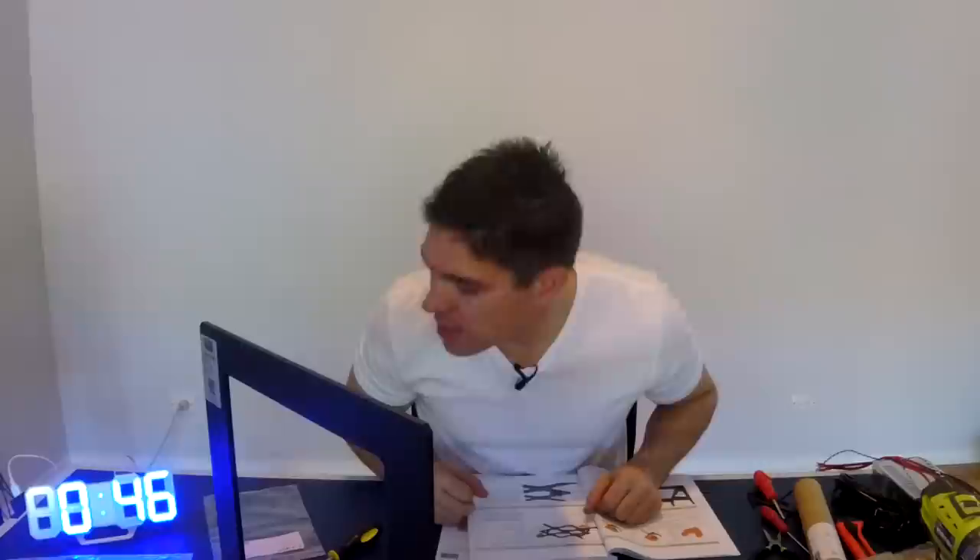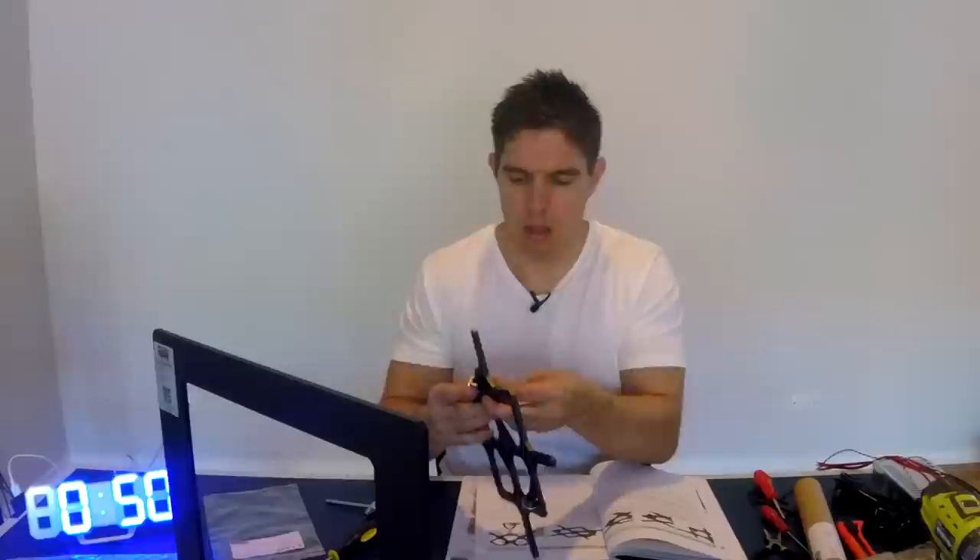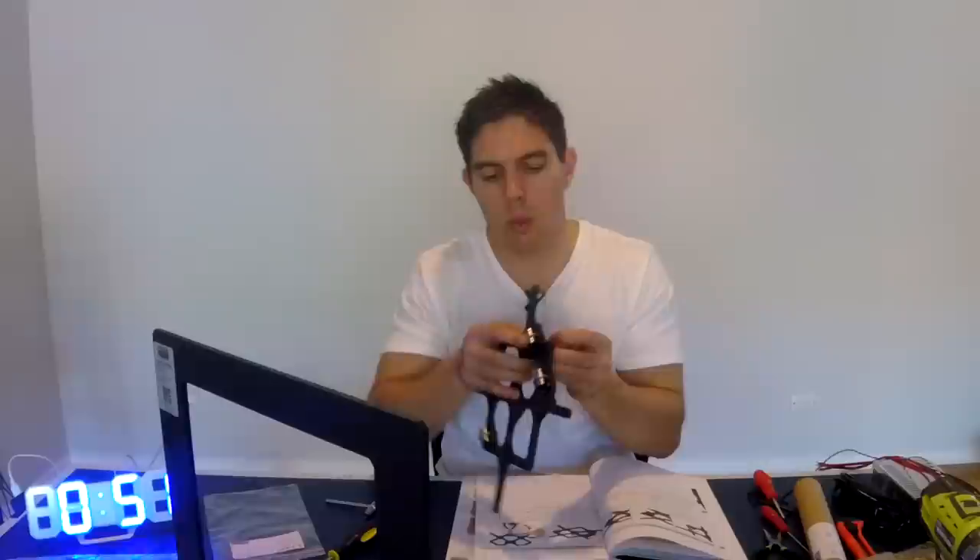Mini-crisis — the camera I'm filming on now decided to beep and carry on, so I've lost a couple of minutes with that. Build time is up to 46 minutes. So far nothing has gone wrong. I think I'm pretty close to finishing the Y axis assembly, so I'm going to keep on pushing through. Apparently this section is really crucial — I need to make sure I have the bearings orientated the right way and that I don't over tighten them. I'm going to use a separate tool to turn these nylock nuts because I know from experience they're a real pain otherwise. I'll leave them loose as the instructions tell me to do because I don't want to crush them.